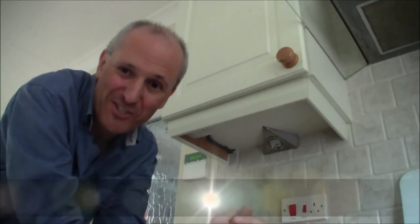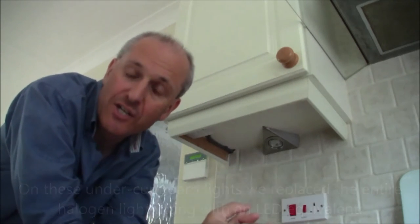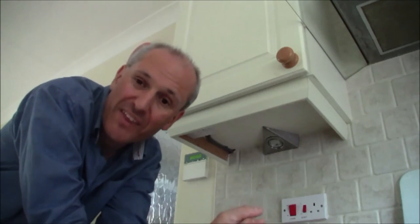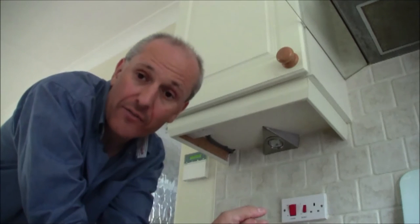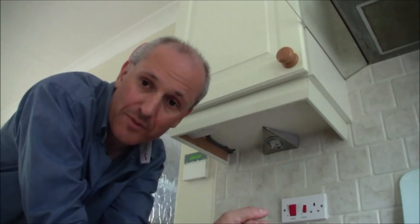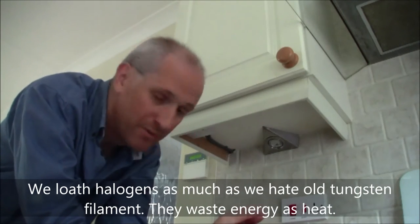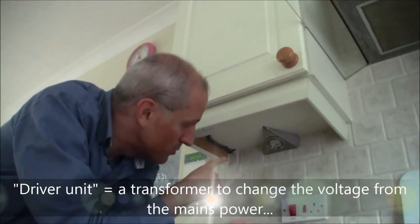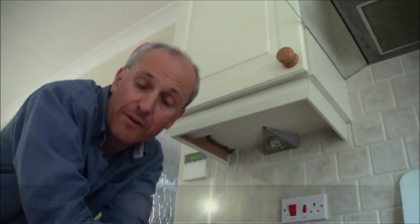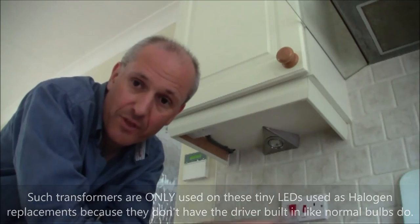Still in the kitchen, where most of the good lighting technology exists — again all LED. These are under-cupboard lights. When we had the kitchen refitted, the original fittings looked exactly the same but had halogen bulbs. We couldn't find a good LED replacement at the time, so we went online and found LED fittings that looked identical and simply replaced them all. These small ones require a separate driver unit plugged in above the cabinets, not dissimilar to the halogen driver — so they plugged straight in, no problem.